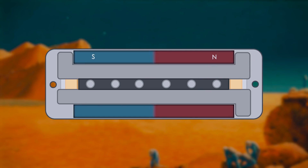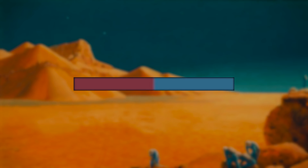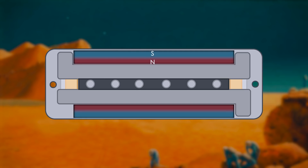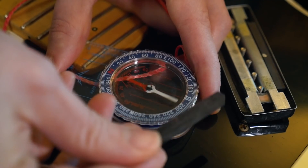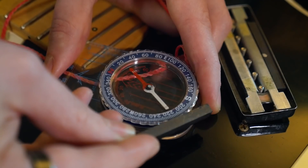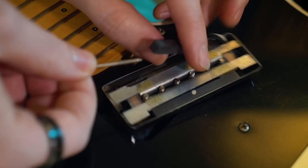Ryan made the assumption that the magnetic bars in this pickup would have their poles at the extreme ends of the long bar, and that flipping it like this would also flip the polarity. This is of course incorrect. The magnets used in guitar pickups have their poles orientated through the thickness, meaning flipping end to end doesn't change the magnetic polarity. However, by rotating it about its long axis by 90 degrees as Ryan did, we can get the north pole to face in four different directions. This gives us 16 different combinations of how these two magnets can be orientated within this pickup, and only two of those combinations will have the pickup working in its optimal fashion.